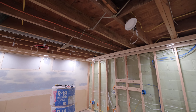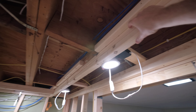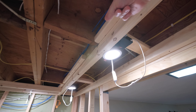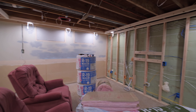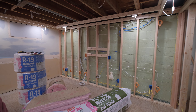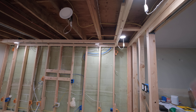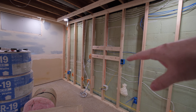We're going to do the ceiling first — so this has to be insulated, then we'll drywall the ceiling and the face of the soffit, because the soffit is going to overhang about five inches so we can tuck in color LED lighting up there for some indirect lighting. We won't be able to get in there with tape, mud, or paint after the fact, so we have to do that portion of the ceiling first. Then we can build the bottom of the soffit with some birch plywood.